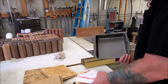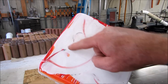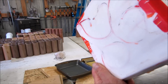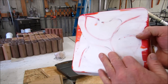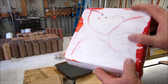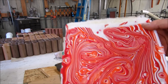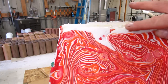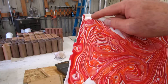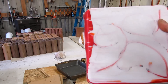My pans are getting kind of worn out, but it still dropped right out. Very obvious there — you can see my comb trails. There's the first attempt, then the second time — awesome. I know I got clear to the bottom because I can see it right here on the sheet. This is going to get planed off. The bottom's still not flat, there's a dip here and a dip there, and that's why this sheet was made thicker. Here's the scorching I talked about — I never want that in a sling so I always trim the outside to get rid of it, because scorching tends to happen around the edge worst.